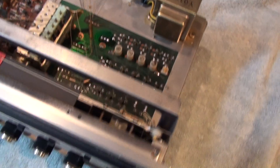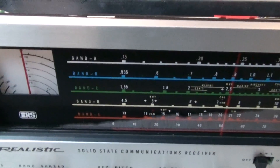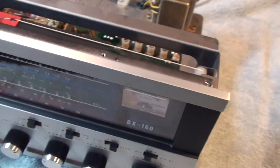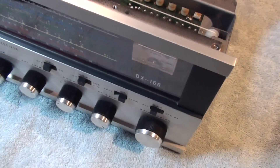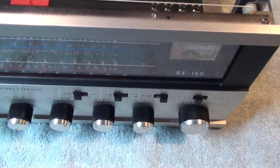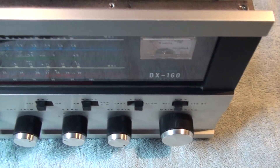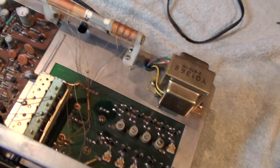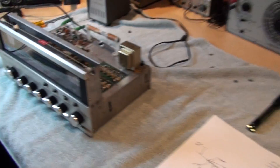With the weak sensitivity, you've got bands A, B, C, D, E — you can see it just corresponds to the A-B-C-D-E on the dial. Again, it could be either band that's either dead or weak, and it's not caused by the band switch. A lot of guys will suggest go ahead and start cleaning the switches and controls — you could do that if you want, but typically these seem to be okay.